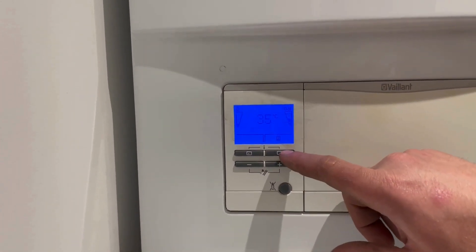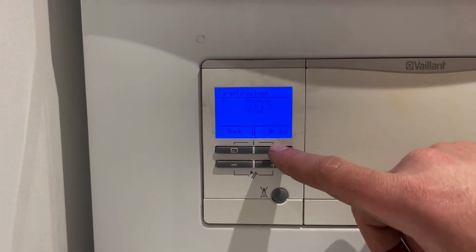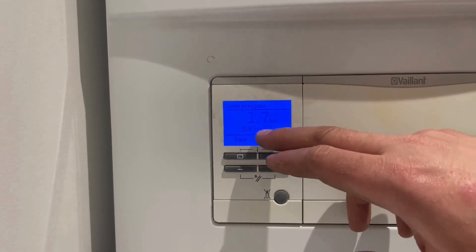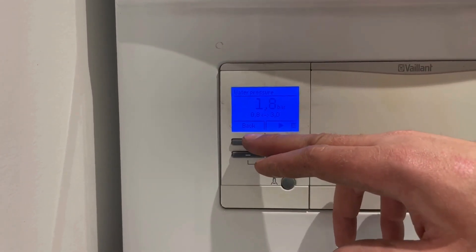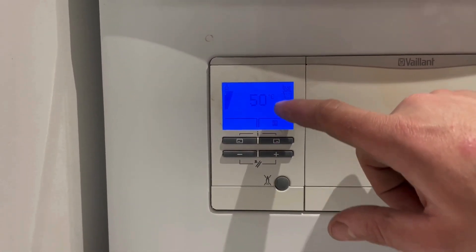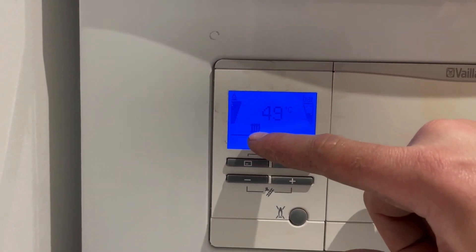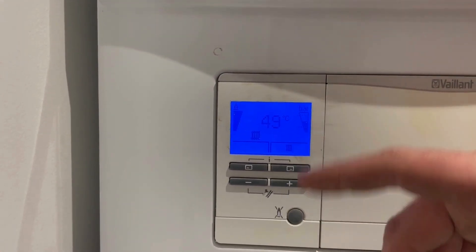Once you've finished with the boiler you can click back on the screen and that will take you to the home of the boiler. Press the radiator button which takes you to the target flow temperature where you can adjust the temperature for the heating — we'll keep it at 70 for this. Then go into the next one which is bar, so in bar we can see how much pressure is in the boiler. When you want to go back out, press back and that will take you to the home screen. On the right column it will show you the pressure, and on the left column it will show you the flame and how strong the flame is operating. Once that is flashing it means there's a demand for heat.